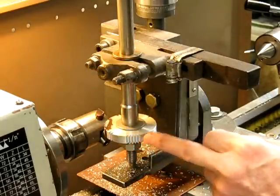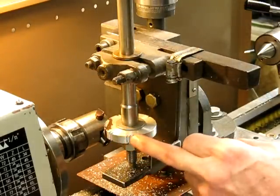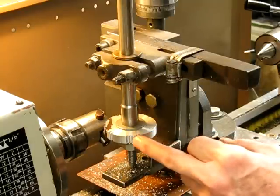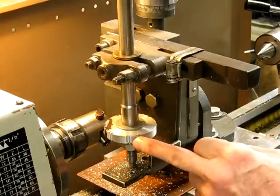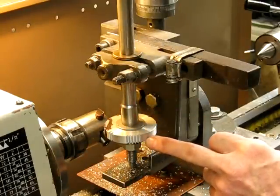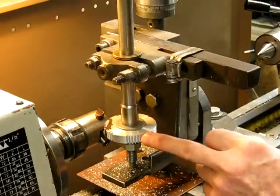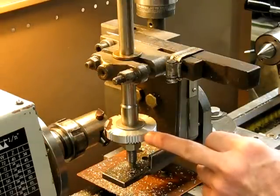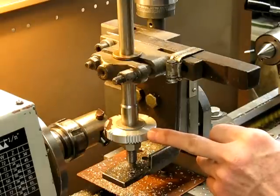This isn't quite the right profile — those teeth are a bit too pointy. For a 50-tooth gear, they should be a bit more square on the end, but that's the only fly cutter tip I had in the drawer at the moment, so that's just what I'll use for the demonstration.